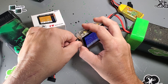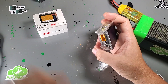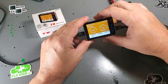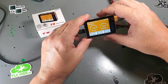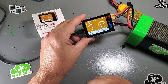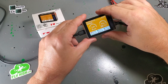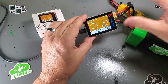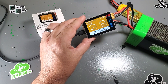Let's try it on my little 65-watt USB-C power delivery — let's see what this thing can do. It's not going to get anywhere near 15 amps, because 65 watts at 25 volts isn't up there. But 2.4 amps is plenty for normal charging. If you're charging a battery like this, that's more than 2C off of a 65-watt USB-C power delivery. You could have this running in the car and be getting 2.4 amps off the cigarette lighter. 57 watts on a 65-watt power supply — that's pretty darn good.